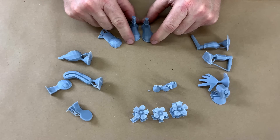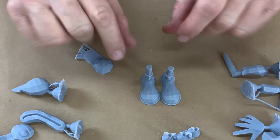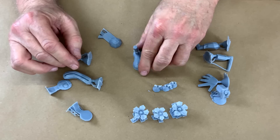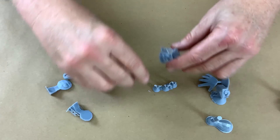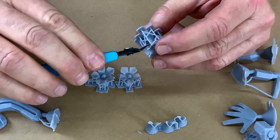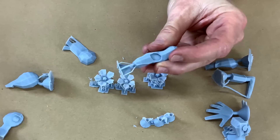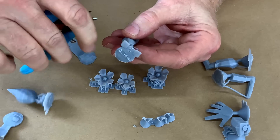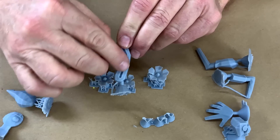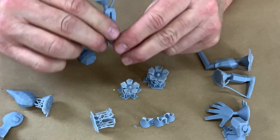After the parts come out of the ultraviolet cooker they are pretty well cured up and ready to go. Some of them, like these shoes, require absolutely no sprues or vents — we're just going to cast them upside down open face. Others, like these flowers, just took a forest of supports and we have to go around one by one and clean them off. I left a funnel and a vent on each one, so I only have to cut off the printer supports, but I'm not cutting off the supports for the resin casting — that's where the resin drops in and the air rises out.